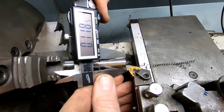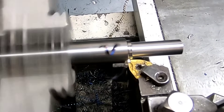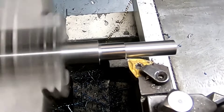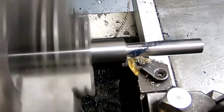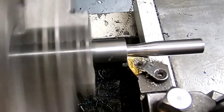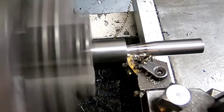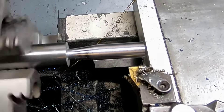Now that we've got her on size roughly, we can start cutting a bit of a shank down on this. The reason for cutting this shank down is to keep the heat from conducting down into the chuck and away from the work. I also didn't turn the whole length — you want to work from unrigid to rigid. If you want something to be accurate you want it more rigid rather than less rigid. If I'd turned the whole length down it would have been wobbling all over the place.